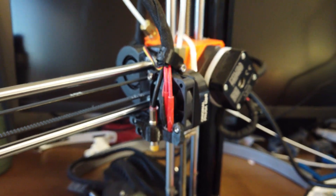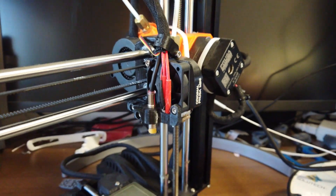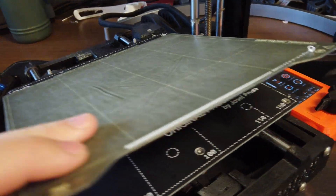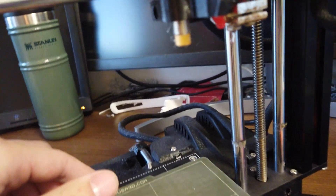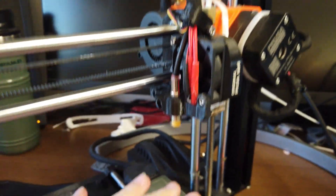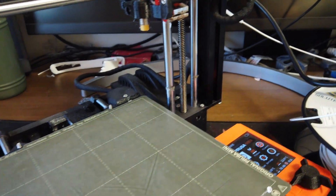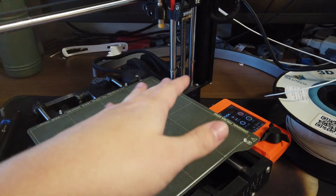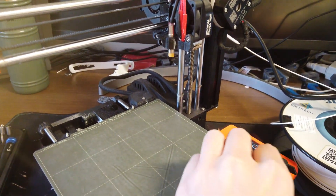This is the Pinda — I'm not sure what that stands for, but it's basically a proximity detector. Right under the hotend carriage is a steel sheet, or a conductive sheet at least. What this sensor does is as it gets close, it'll detect the surface, and that allows you to level based off of the different readings it collects. That's how a bed leveling system works.